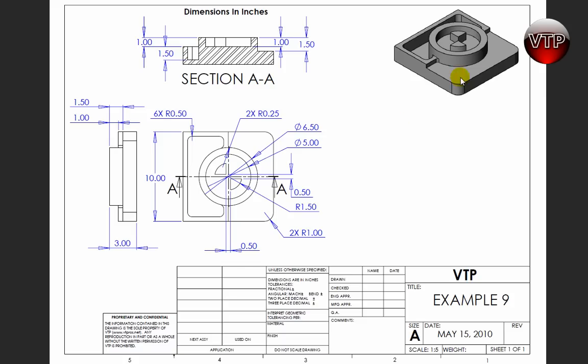We're going to use the 2D plane to design this geometry. There are a couple things I want you to see before I start sketching the part. The first layer on top will be the top of the circle and the top of those two quarter circles popping out of the middle. The inside is going to be extruded cut about an inch from the top, then there's a level at an inch and a half from the top, and a third level — the pocket — at two and a half inches from the top.